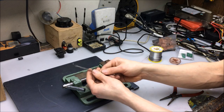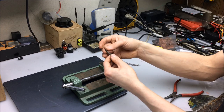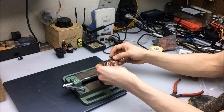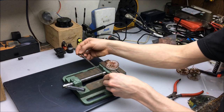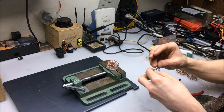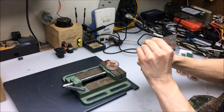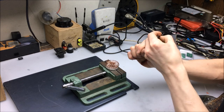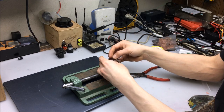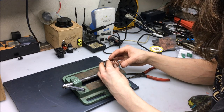We have to keep it all in one piece as we're doing the soldering process. Right here I have some resistance wire from a hairdryer, and I'm going to join the two ends and use the tension from this to keep it all stable as we solder it together. We're planning on using a heat gun in conjunction with the soldering iron. Jeremiah has a different method: he uses a butane torch to center heat just the nut, allows the heat to soak into the wire, and then controls where the heat flows to pull the solder in the direction needed. The second method is to use a carbon rod pulled from the center of a AA or AAA battery — those work very well with contact resistance, getting up to several thousand degrees just by touching them to the surface with some current flowing through. You can do precision point soldering at very high temperature using a single 18650 lithium-ion cell to supply that current.